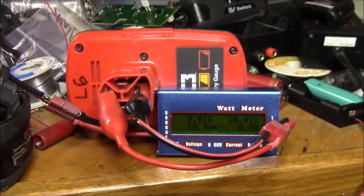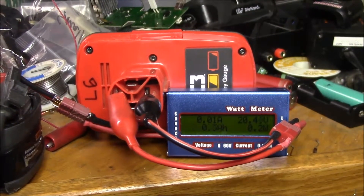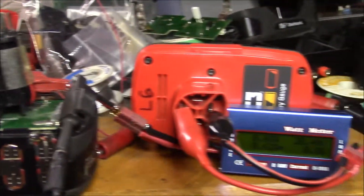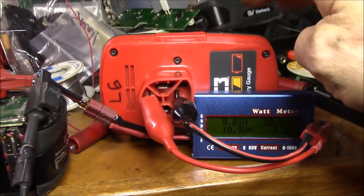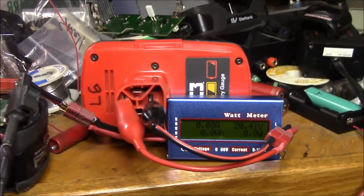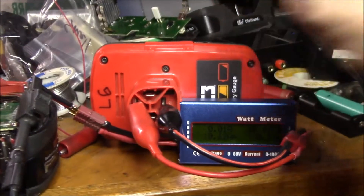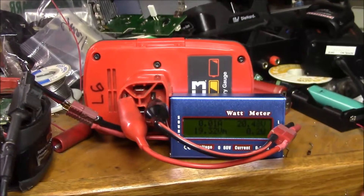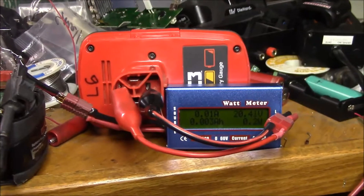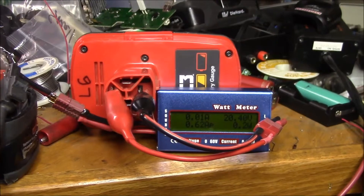These packs are shutting off. I might try a little lower current — that one was 0.6 amps and I charged this one at 0.4 amps, so maybe I'll try that for an experiment. But the Craftsman charger uses about 3 amps. Interestingly, even the bench supply can trigger these to shut off, though it's a lot easier to check here since I have meters and it's on my bench.